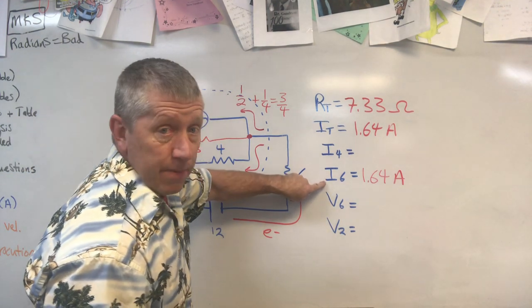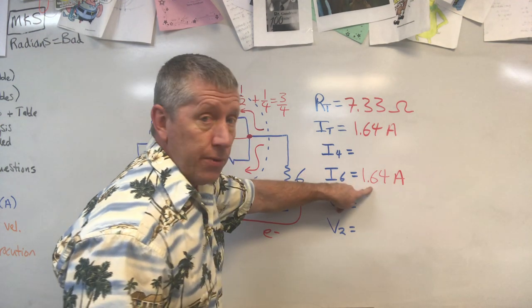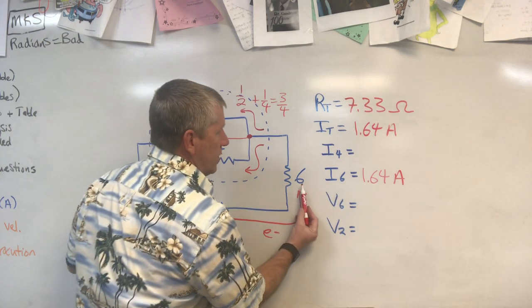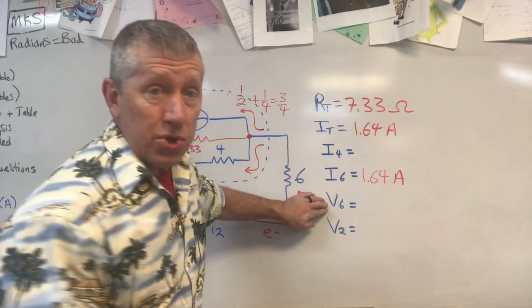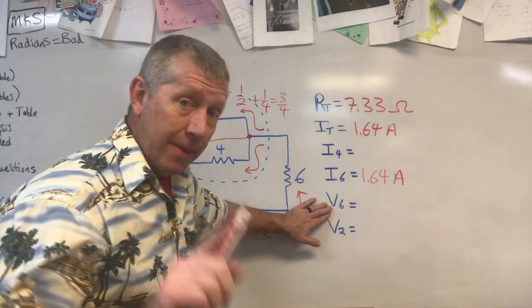That was easy, remember? When things are in series, all the current has to go through it. We can use that to our advantage. We can say, all right, I know how much resistance you have, and I know how much current's going through you. I can figure out the voltage going through you very quickly, very easily. So let's do that first. That's going to help us.